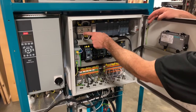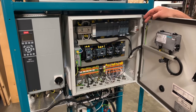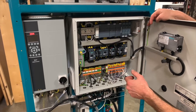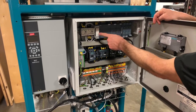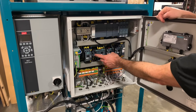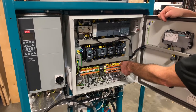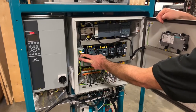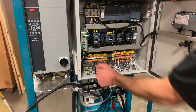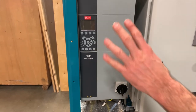At the top left, you'll see our phase sequence relay. Because the D30 is often used as a mobile unit and can be put in places that may not have consistent phase sequence, we've equipped it with this relay that will automatically switch to make sure your motors are turning the correct direction regardless of your phase sequence. We have the phase sensing circuit, our PLC with all the inputs and outputs, motor thermistor sensor relays, main contactors for the various motors and heaters with branch circuit protection, some relays, terminal blocks going out to the various sensors and components, and on this side our power supply with additional fuses. The control box also has a thermostatically controlled fan to keep temperatures inside the panel in check. The frequency drive controls the speed of the discharge pump — everything is automatic and you don't need to adjust any settings on it.